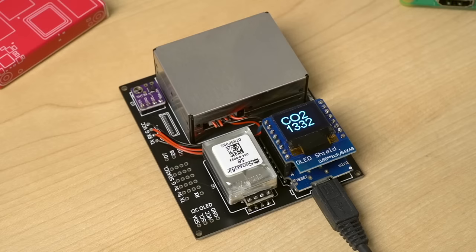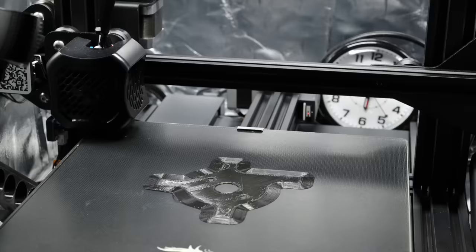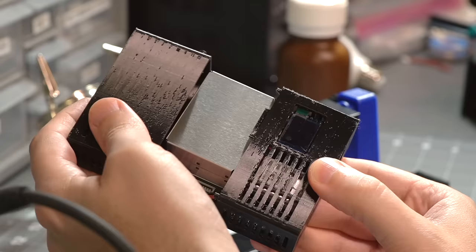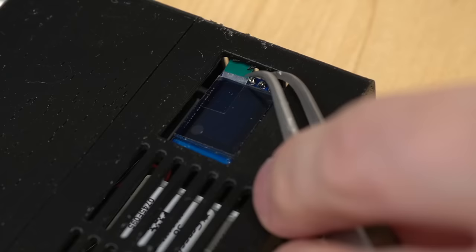So we have this nice-looking little board assembled, but it's not ideal for mounting anywhere. Ideally you'd want it vertical in an area with some amount of air circulation, so setting it flat on a desk isn't that useful. Luckily, AirGradient also has a simple 3D printable case design along with a wall mount bracket. I grabbed the STL files from their website and printed both of them on my Ender 3 — first the wall bracket and then the two halves of the case. Once that was done, I slid the PCB into one half and popped the other half on. It's a friction fit and not necessarily the best fit in the world, but it works great after you put it in the wall mount holder, which kind of ties the whole package together.